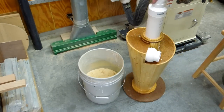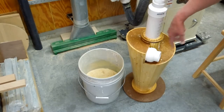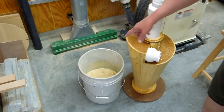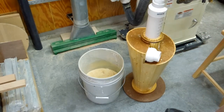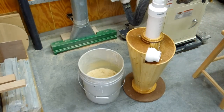If you have a shop vac and you can maintain a large volume of air passing through this, that will keep that material spun up and it will knock out more of those fines. And if you could put this on top of a small drum, that would get that collected material further away from the bottom of the cyclone. If you're picking up larger shavings off of a portable planer or a joiner, you're probably better off to leave that 5 inch opening at the bottom — it's less likely to bridge over.